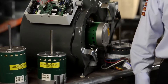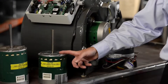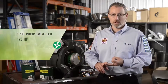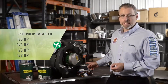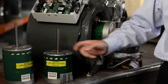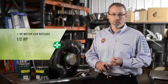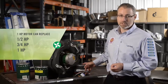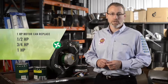The Evergreen IM is built in two versatile sizes. The one-half horsepower motor can replace one-fifth, one-quarter, one-third, and one-half horsepower PSC sizes. Its stock number is 6005. The one horsepower motor can replace half horsepower, three-quarter, or one horsepower PSC motors, and its stock number is 6010.